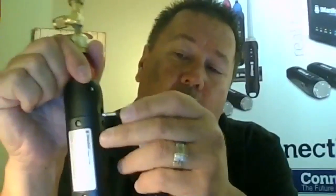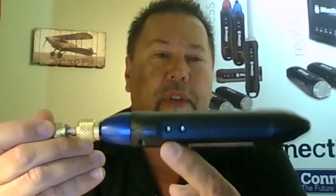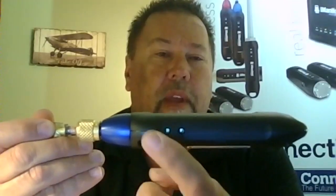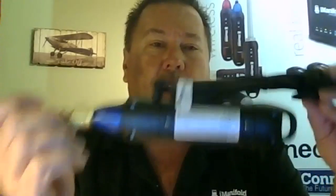This is my high side liquid line temperature in T1. Now these are mapped automatically, so when you plug this in, it's going to show up as your liquid line temperature. On your low side probe, same thing: micro USB, and we have the two temperature ports here. T1 is mapped automatically to suction line temperature. We're going to plug that in. And we've got our low side with our suction line temperature probe plugged in.